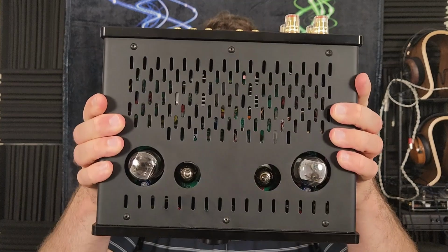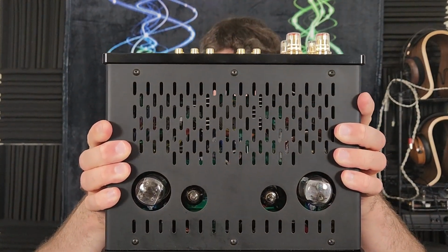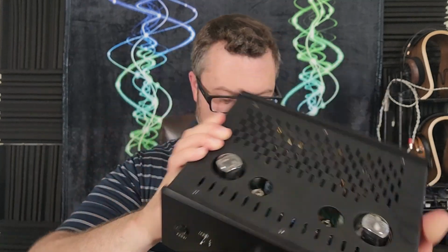All right, the MZ3 is a vacuum tube design here, and it has two sets of tubes on it. The stock configuration is two 12AT7 input tubes, and then two 12SN7 output tubes. All that, and you can adjust to 6 SN7s if you want, if you switch some jumpers around. I will leave LTA's website to explain all of that in further detail.